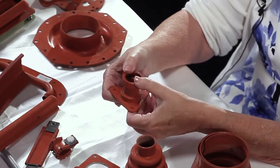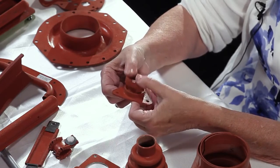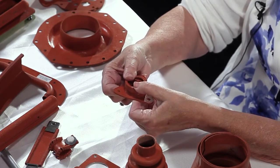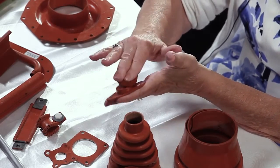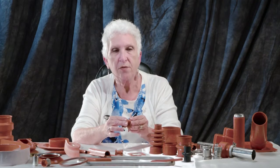The way this works is instead of a 90-degree angle here, we've built in a rolling diaphragm. So no matter how many times you move this, you will not crack the material. And as you can see, you can compress it totally, which means even if you have a very narrow gap, you can install your duct. As far as motion goes, you can get enormous motion in any direction with very little effort as opposed to current convoluted ducts. This has been so successful that we've been able to do left-hand and right-hand parts with a single tool as long as it's not an enormous degree of motion.